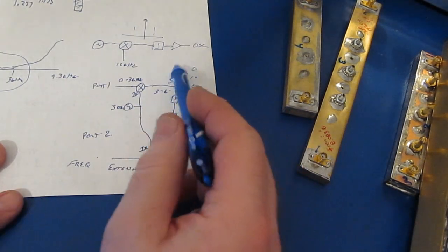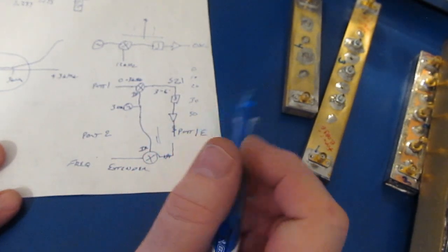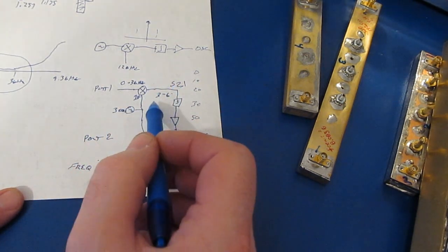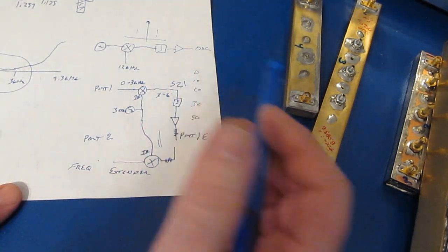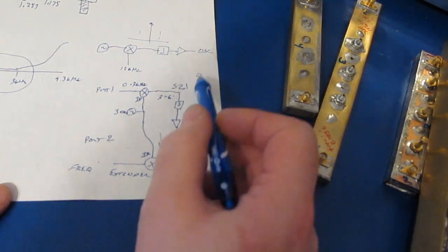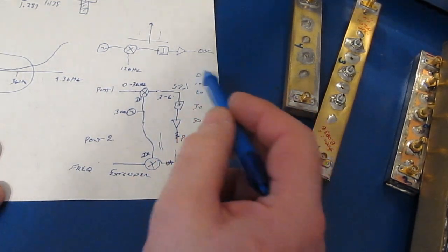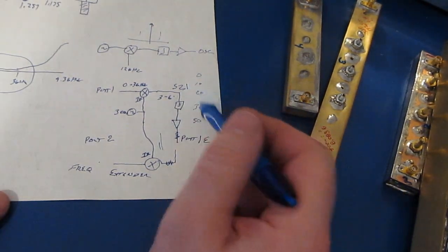What I'd like to do today is focus on the circuit and prove that it's actually doing what I claim. The first thing we want to look at is: what is the frequency at this node — is it really the upper sideband? When I stacked those attenuators, how did we even know we were running at 11 GHz? Maybe it was only 6 GHz and the performance looked good because we weren't actually at the intended frequency.